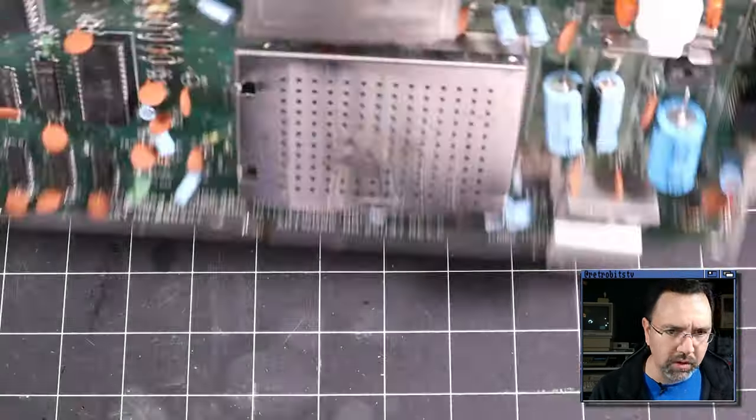All right, we know we have a good CPU from my machine. We know the PLA works because we tested it in my machine, and we suspect the VIC is good because it's drawing the white border and generating the phi signal for the CPU. So I'm not going to plug in the dead test. Let's just flip the switch and see what happens. Ha-ha! There we go. Commodore 64 BASIC, 38,911 bytes free. So we have another dead CPU.